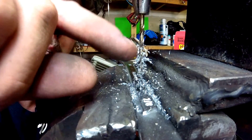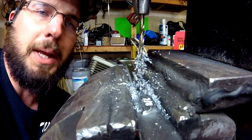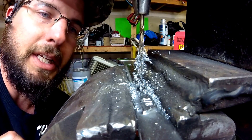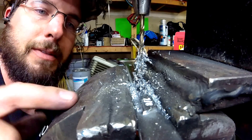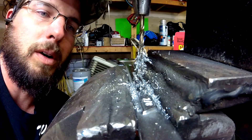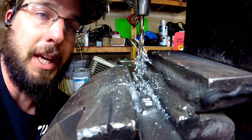It's making about the same kind of size chunks. Everything's not discolored — there's no blacking or bluing or overheating. We still have not applied any lubricant. This is the same drill bit that we used in the very beginning, and it's cutting through this very, very nicely. Your tool steels are somewhere up there in like the 40s and 50s on the Rockwell Hardness Scale if you want something to compare that to.